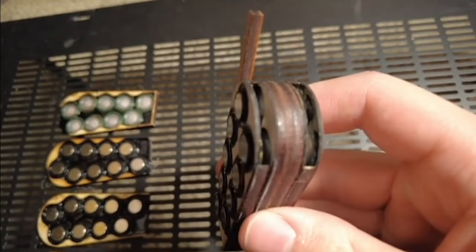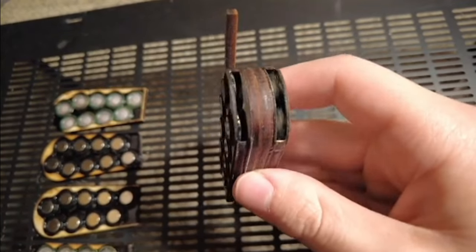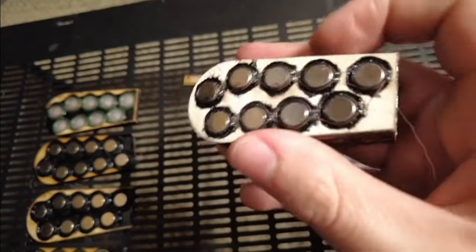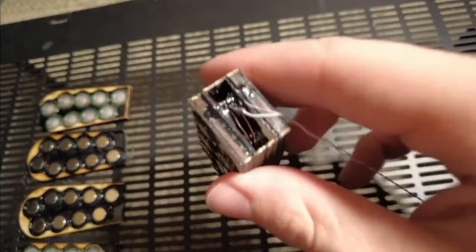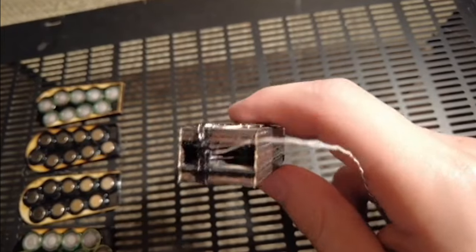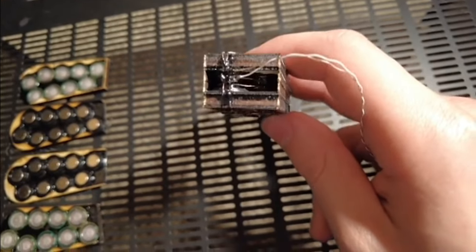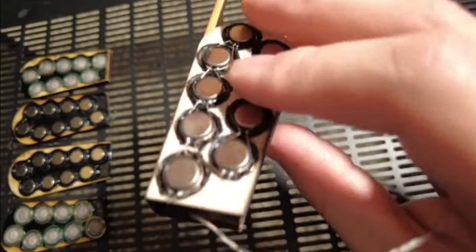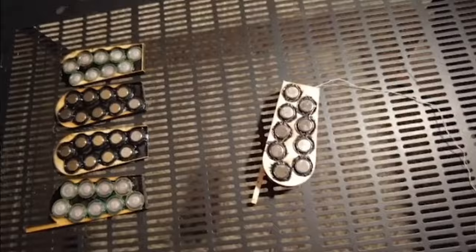Here, you can see that 2 sets of layers assembled facing the speakers fire inwards towards each other to create a pressure wave that comes out of the slit. This module also has a unique back venting system that actually helps mechanically and acousto-pneumatically reduce some of the unwanted mid-bass, specifically anything from about 120Hz to 350Hz, and actually exaggerate and bring out some of the sub-bass, for this module, 37Hz all the way down to 26Hz.